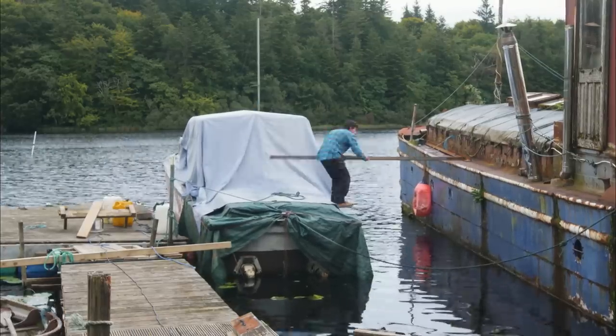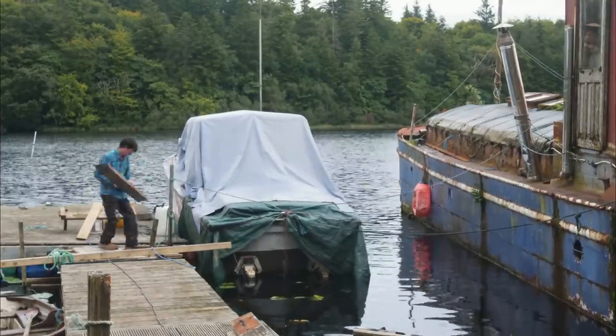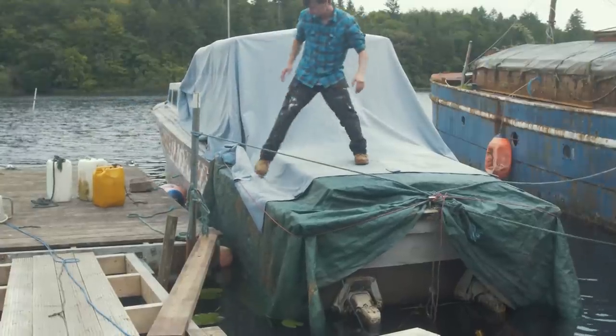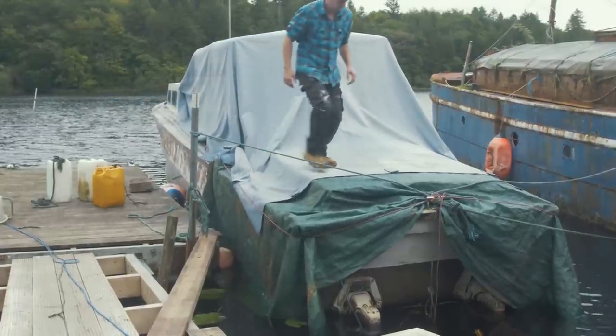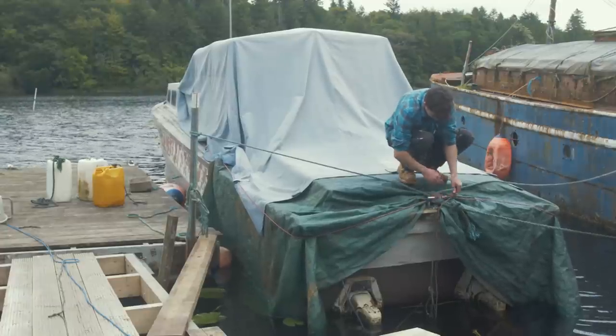They sheeted the entire hull in epoxy and fiberglass mat right up as far as the rubbing strake, of course. This is why, without a doubt, the boat is afloat today, and it's allowing me to continue the work on the boat.